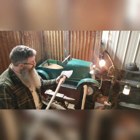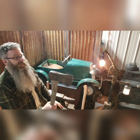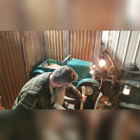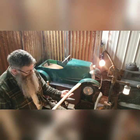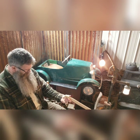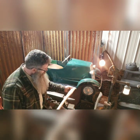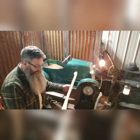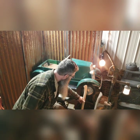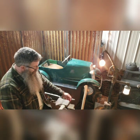Today we're going to be replacing this axe handle because it's all jacked up — been chewed up and beat up over the years. Still a good head, so it's just cheaper to replace it than to buy a new one. The first thing you've got to do is get yourself the appropriate handle. I try to find one with nice grain. It's fairly straight, just got the tiniest little bit of bow in it. You want to get the appropriate size — not just the length, but for the size of your head, as shown at the beginning of the video with a measuring tape.